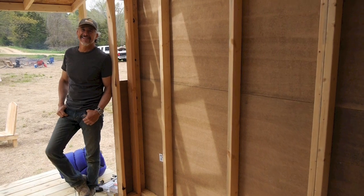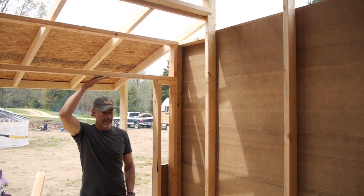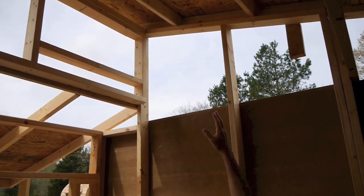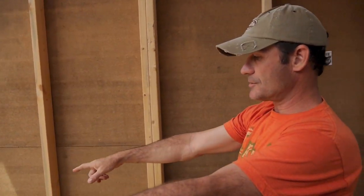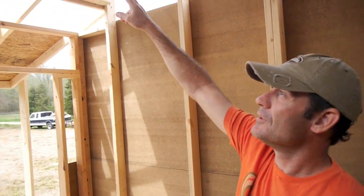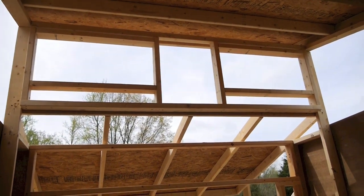You're talking quite a bit of height up here — 10 and a half, 11 feet even. It's going to have a 6-foot slider, the cheapest new things I can buy — a 6-foot vinyl slider for 300 bucks. Two windows up high, two windows in the back. There are four casement hopper windows like for a basement, with clear glass — about 60 bucks each. That was the cheapest windows I could find.